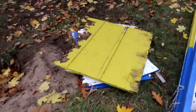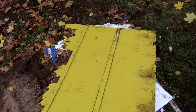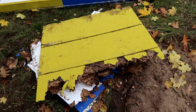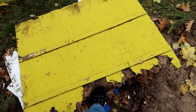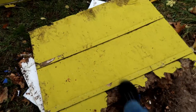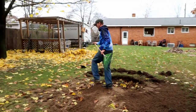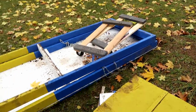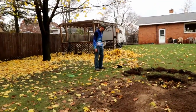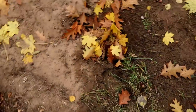When we built the A-frame we told you guys we used the wrong wood — we had the intention of actually getting the right wood because this is OSB, which wasn't what we meant to buy. We painted it, and when we realized it was wrong, we used it anyway. This just sucks up water. If you actually look at the instructions on how to build this, we specifically tell you not to use this wood. All of this filled up with water, so we're gonna get new tops for it, paint them, and fix up the A-frame again. The frame is still good, just those boards were not the right boards to use. We could try doing the composite deck board — it won't be heavy, but it's not cheap.